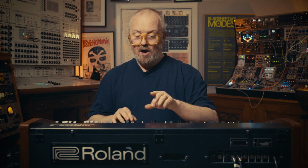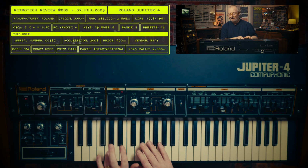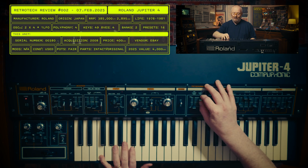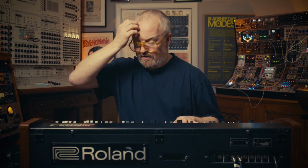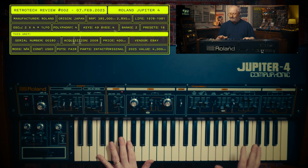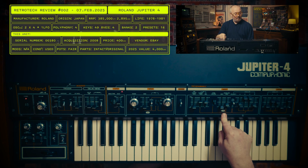And then we've got our LPF, low pass filter. And some resonance here. There's a key follow thing which basically adjusts the amount of voltage going to the frequency module depending on the pitch. Slightly more subtle. Now I'm going to come back to the low frequency oscillator in a minute. Now this section can be modulated via the LFO, which is just situated here.